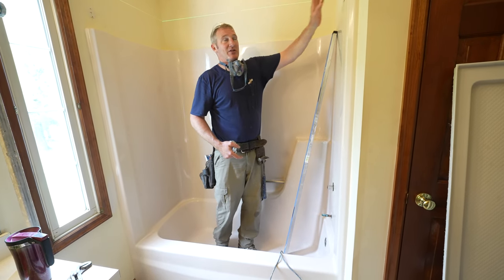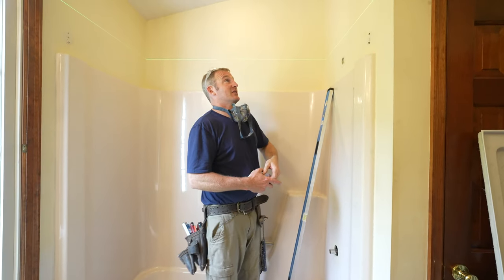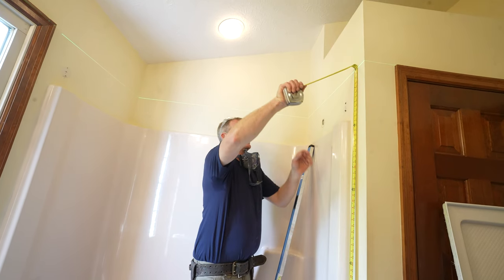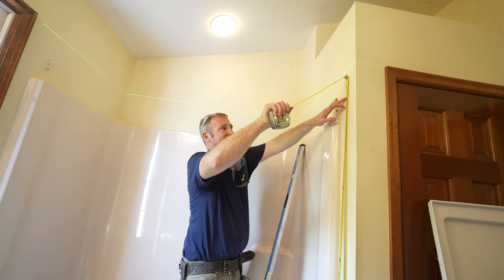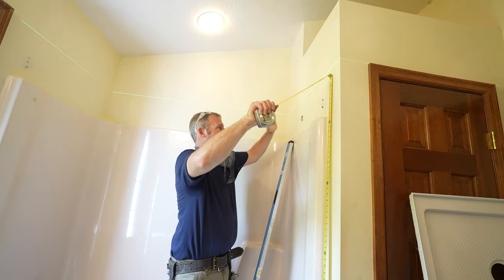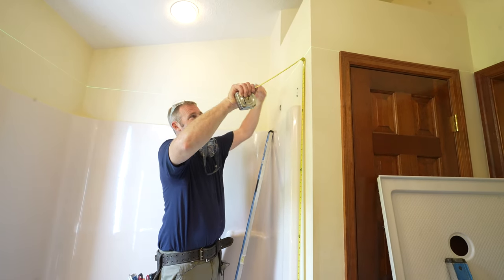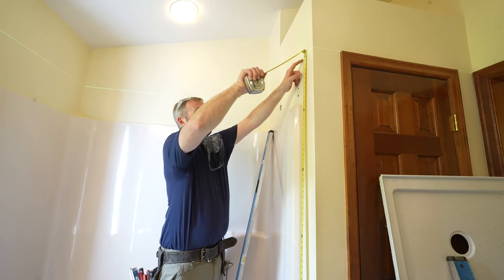As far as evaluating the drywall or where to cut, it really depends on your tile layout and where you want to go. This is a unique situation with a partition wall that doesn't go all the way to the ceiling. We're planning to go about 84 inches for the waterproofing. I plan to move the shower head up another three inches — the old standard was 78 inches, but that just isn't high enough anymore, especially with rain shower heads. So I'm going to set the shower head at 82 inches and bring the waterproofing up a couple inches above that. Anything above the shower head doesn't strictly need waterproofing, but it's a good idea to go a couple of inches above. So we'll cut the drywall out at 84 inches.